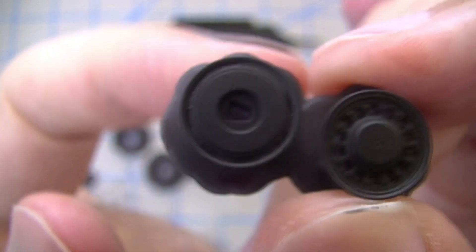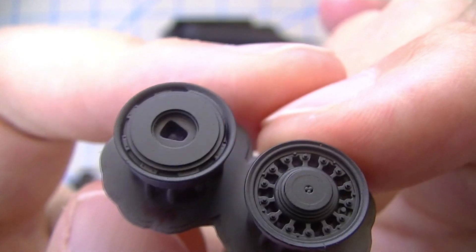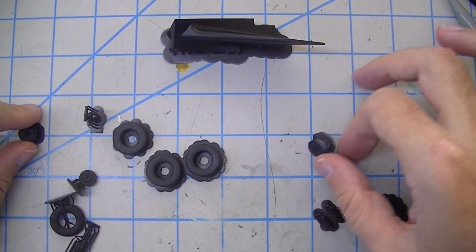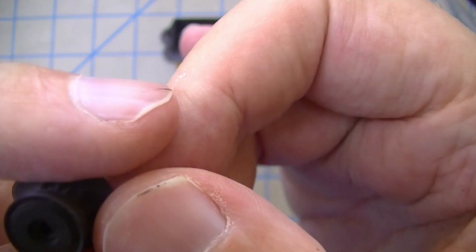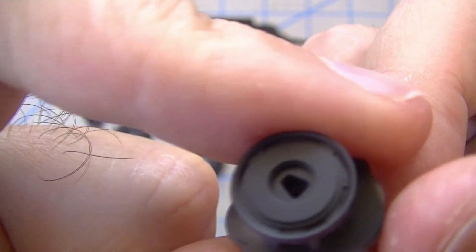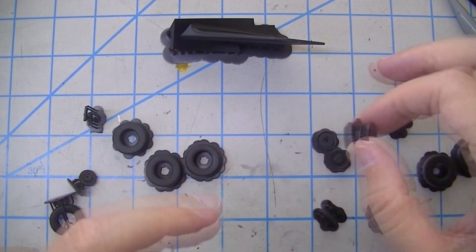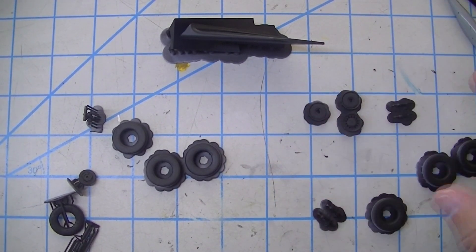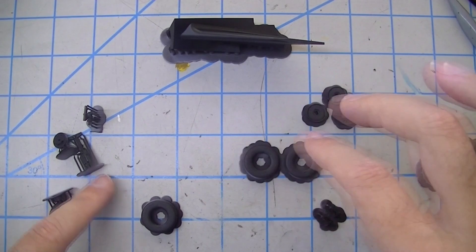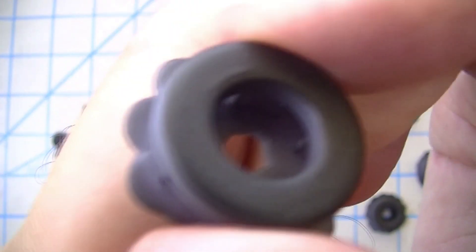Really, really good. There's a little bit of a flaw if you look at the 12 o'clock position on this wheel — it did not print all of those little insets in that lowest part, it's kind of filled in right there. I printed another one the same way just to see if it happened twice. What I suspect is that it's not a file problem or a print problem — I think it's resin that pooled in there and never drained out or got washed out and then cured. I mean, I'd try to fix it if I were using that on a kit, but I think that's probably what's going on.